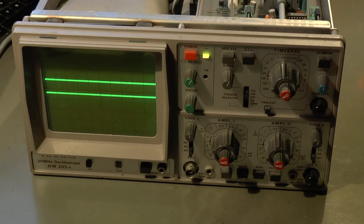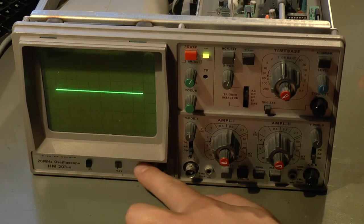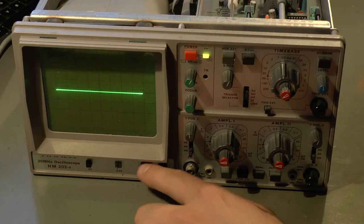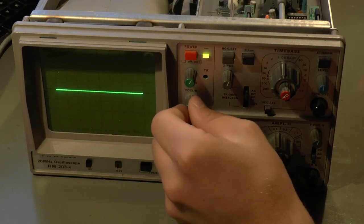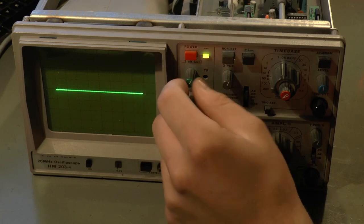Initially I was going to say no, because the front controls do not affect the signal at all — it would only be coming from some post-amplification or circuitry further along the signal chain. But seeing this, it might actually be coming from the front ends directly. One weird thing is the fact that it's across both channels, which makes me suspect it might be a power supply rail. We're going to see what we can find about that later. The scope also has a component tester, and switching that on shows the trace is actually quite fine.